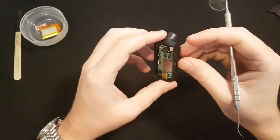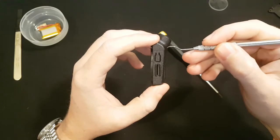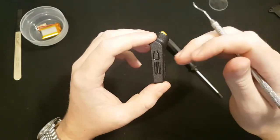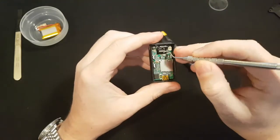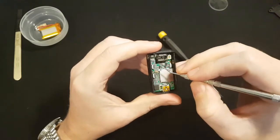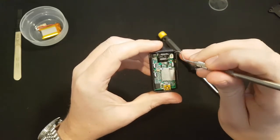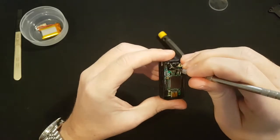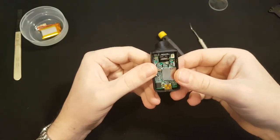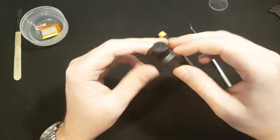What I actually did was take some side cutters and cut away the black plastic part on the top side of the Mobius Mini case until I could carefully pry that up and away from the board. What other people have done is actually lift the board out directly. You just have to be very, very careful because all these tiny little capacitors and resistors — you definitely don't want to go damaging one of those. If you're confident you're never going to use your Mobius Mini for anything else, I actually recommend cutting away the top.